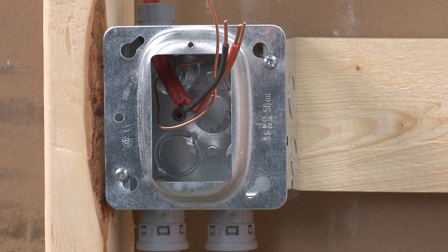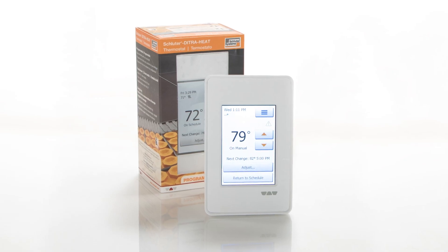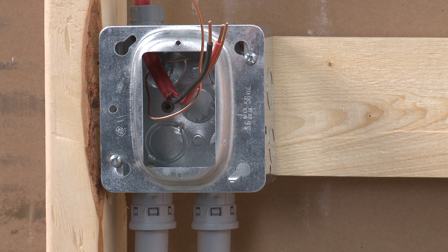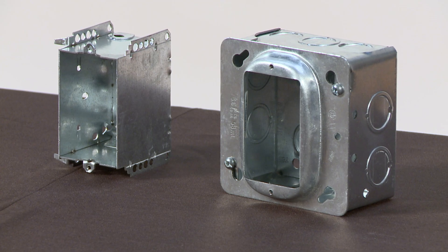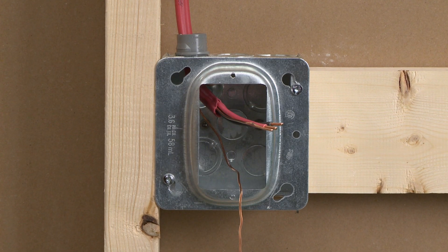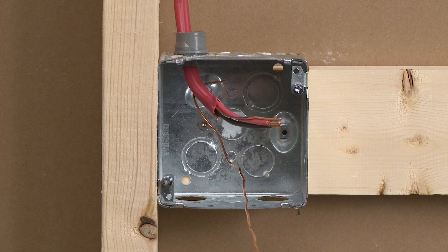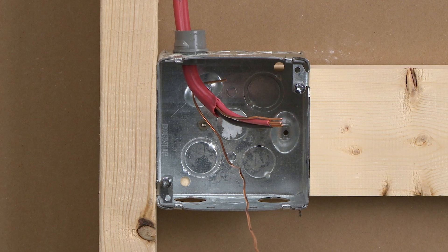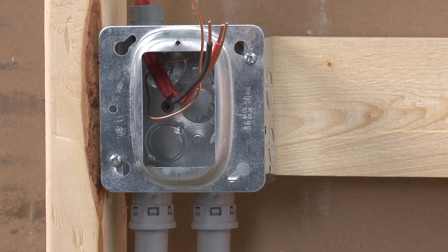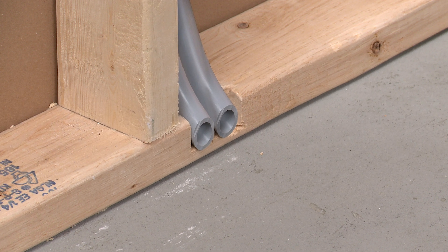The total current from all branch circuits cannot exceed 80% of the breaker limit. In this application, we will use the DITRA-HEAT E-RT thermostat mounted on a double-gang electrical box with a single-gang mud ring. A single-gang deep electrical box or a double-gang electrical box with a single-gang mud ring is recommended to provide room for the wiring. The junction box must be sized according to the electrical code in your region and must consider the use of pigtails and the space occupied by the rear section of the thermostat. Two sections of conduit were run from the electrical box to the base of the wall to protect the heating cable cold lead and floor temperature sensors.